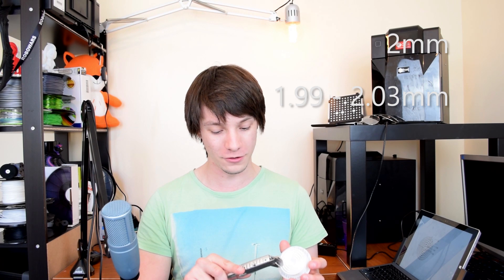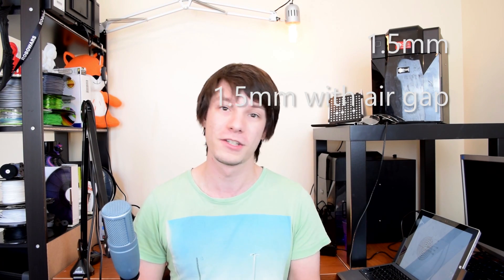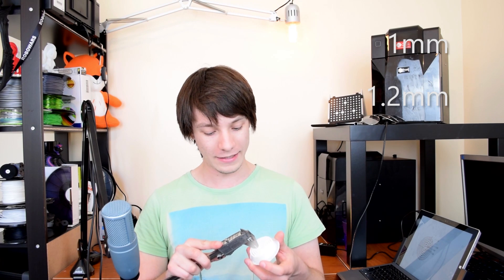So I've got my trusty calipers — let's have a quick look. The 2mm wall is actually scarily close, about 1.99 to 2.03, which is very, very good for an FDM printer. Similarly, the 1.5mm wall is very accurate even though it has no fill in the middle — that's clearly what the printer is trying to do, print it accurately rather than strongly. Going down to the 1mm, things start to get a little inaccurate at 1.2mm. And down to the 0.8mm, it's no longer even close to 0.8 — it's again 1.2. Similarly, the 0.6mm is 1.1. So clearly that's the thinnest wall you can print on a UP printer currently.